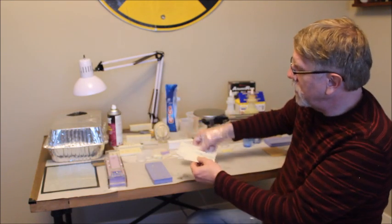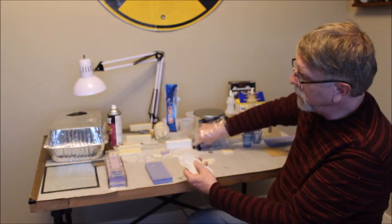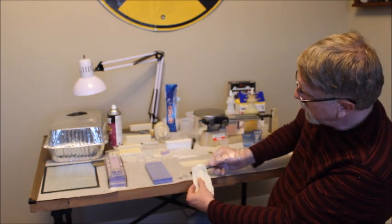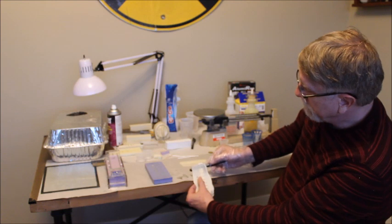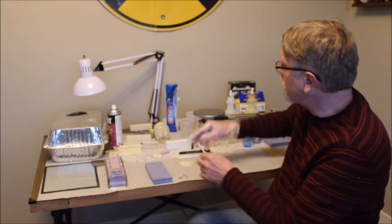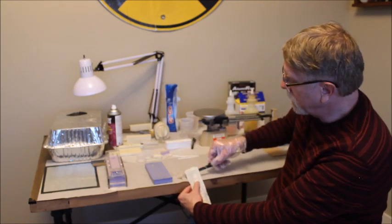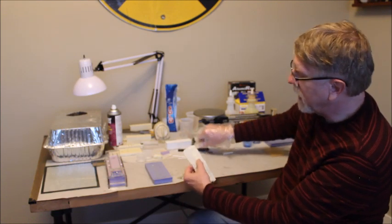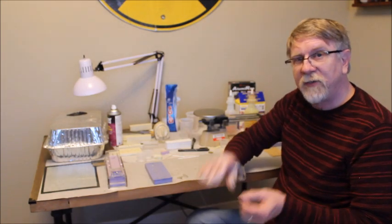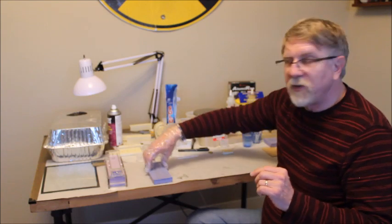flash on your mold. For example, on this end of this mold, you can see the magic marker behind through the flash. That means you've got a really thin flash, and for example on this one, you really can't see it as well. That's got a lot thicker flash. If you get really thin flash, you don't need to worry about sanding it off. It makes the cleanup much easier. It makes using the part much easier. You get a much more consistent piece.